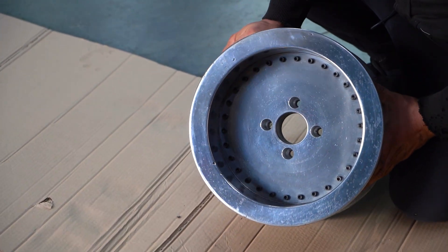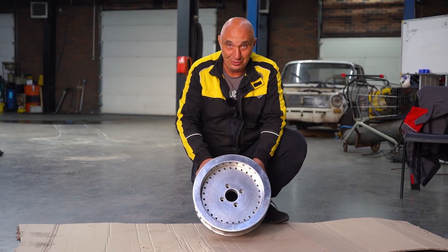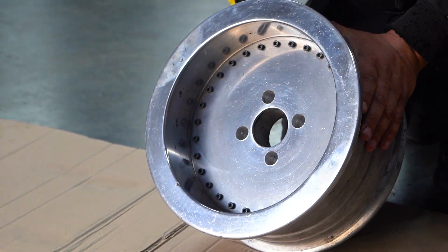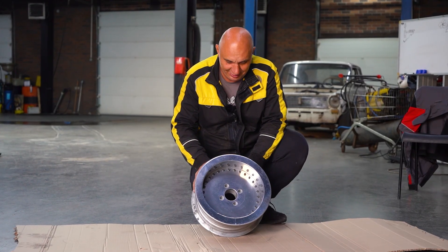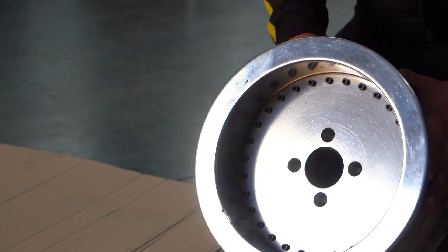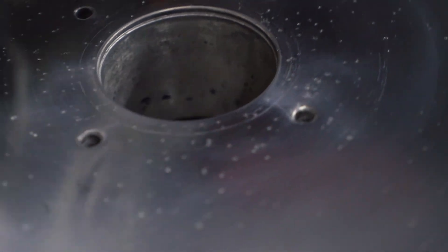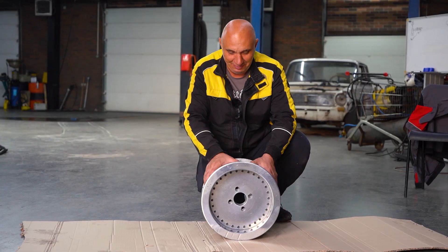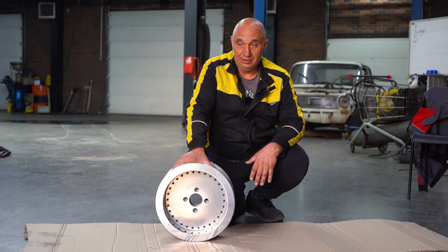Check out what we got here. We've put the wheel together and look at how nice it is. Pretty sweet, eh? It's pretty old school, like in the olden days, and it is a truly deep dish. We've polished it - we were polishing and machining it. After a long time spent polishing, here's the result. We do not have proper tooling for casting and we don't have additives that you'd use when melting aluminum. So we still got craters or bubbles inside the metal - why they didn't escape is beyond me, probably down to not having the right additives. But the wheel actually looks quite nice. So let's go find a good tire, fit it to the wheel, put it onto a decent car and see what that looks like.